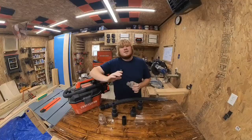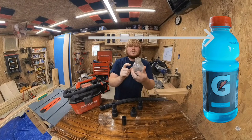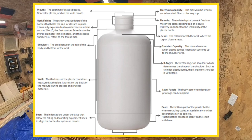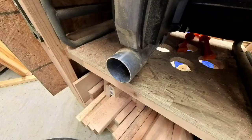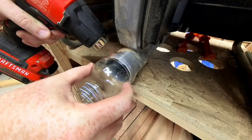Avoid applying too much pressure or forcing the bottle inside the hose. This will permanently bend the bottle's shoulder, which you can see I had done with this one. And yes, you are going to learn the entire anatomy of a plastic bottle today, folks — each part has its own name. Remove it from the hose and, as you can see, it fits loosely on your saw's vacuum port. Apply a little more heat, rotating the bottle so it shrinks evenly, and soon it will gently embrace the port in a warm, loving hug. And you're done!